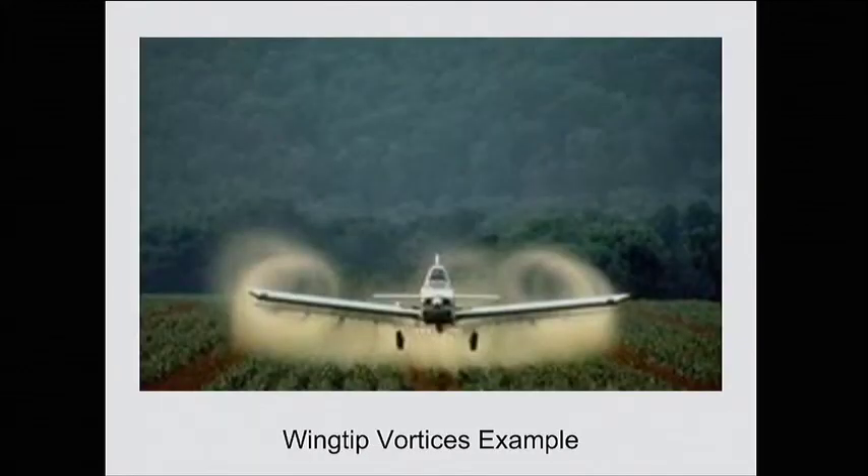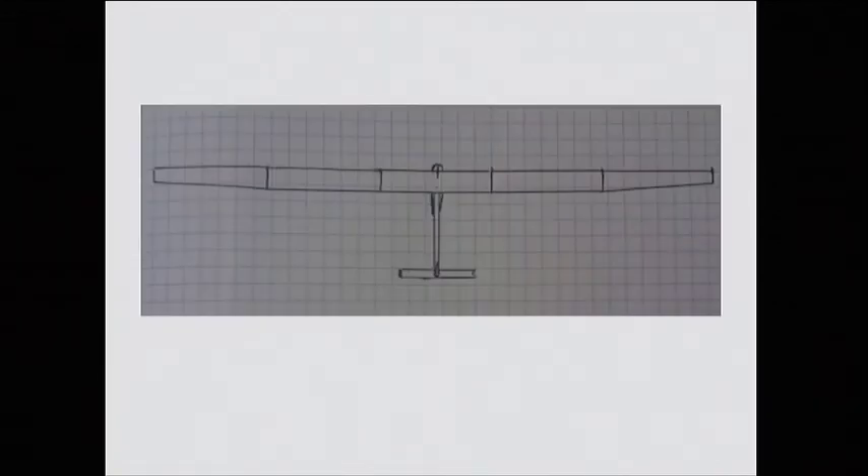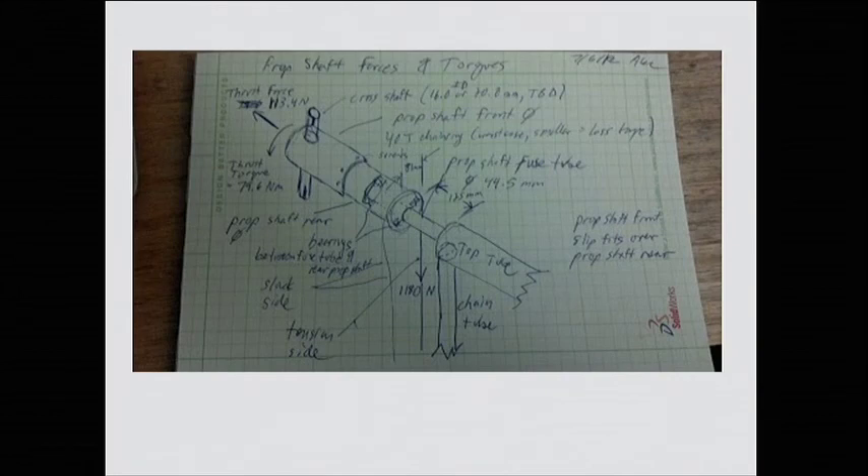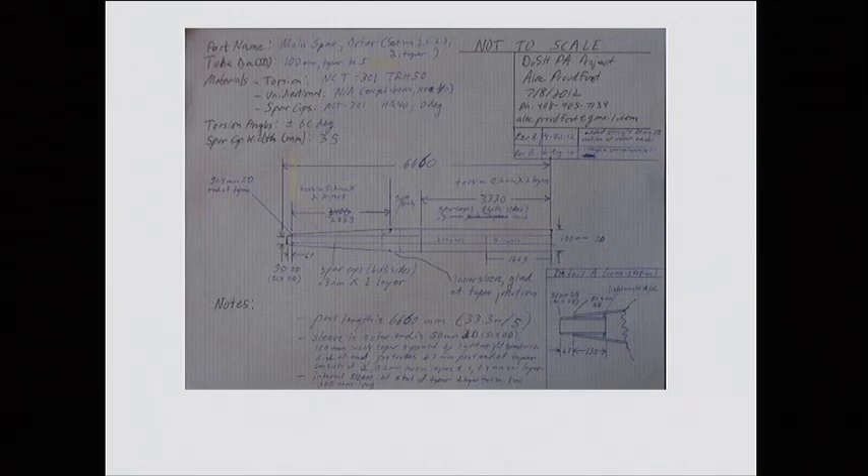This is a visualization of what's happening with induced drag. The drag when you create lift is basically high pressure on the bottom leaking over to the low pressure on the top and creating a big vortex on each wingtip — that's all wasted energy. The longer and thinner the wing is, the smaller that vortex is. When we first designed this, I did the spreadsheet, made some hand-based sketches, and eventually did finite element analysis in SOLIDWORKS. I didn't want to spend the time to do detailed models of the entire thing since we're basically just building tubes — so from the finite element results we made some templates, iterated with finite element, and came up with the dimensions.